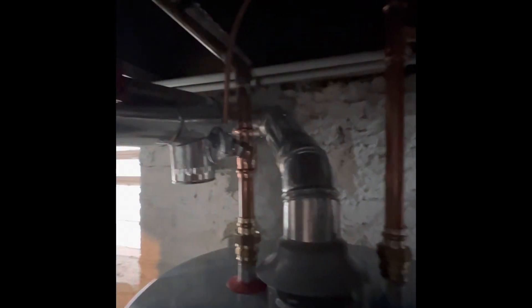Plan on switching out our furnace, turning it sideways, separating our return, going all the way down to the trunk line, starting that replacement here. Reconnect, put a media cabinet in there, rework our electrical, rework our gas.